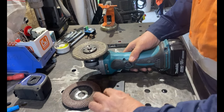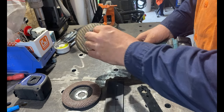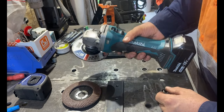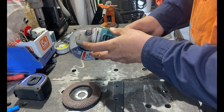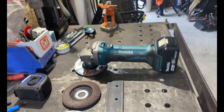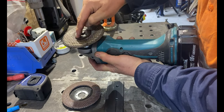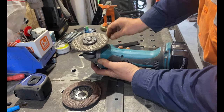All angle grinders come with a key that inserts into the little hole inserts on the lock nut. On the top of your angle grinder there's a locking button that locks your spindle. Press it in — you may have to turn slightly until it locks. With the spindle locked, insert your key and turn anti-clockwise to remove the lock nut, then remove the grinding disc. Grinding discs are a lot thicker than cutting discs, so you have to use the lock nut differently. The lock nut has a machined top that fits into the inner diameter of the grinding disc — for grinding discs you have to turn the lock nut upside down so that machined surface goes down inside the disc. Otherwise the disc will wobble and be out of control.